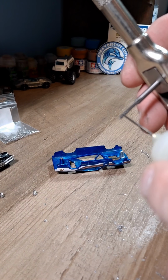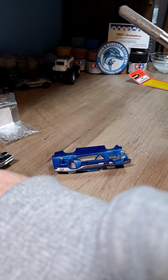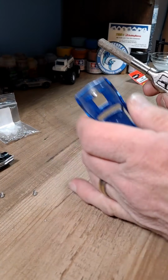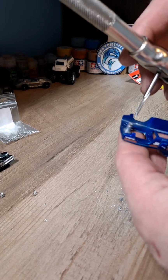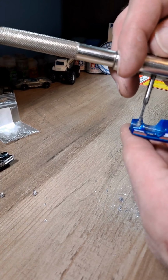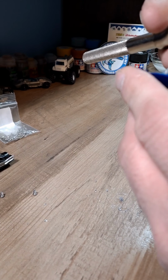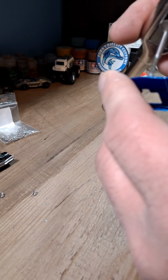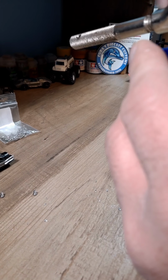Excuse me. So again, I have my 2mm tap. Just a little bit of oil on there, just to keep it lubricated. And to get it started, you got to go nice and slow and easy, especially with the big handle like this. You got to keep it balanced, keep it centered and straight. So it's a bit of a challenge, but nice and easy. You can get it started. Once you get it started, you're good.